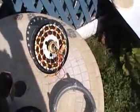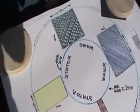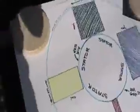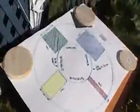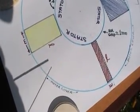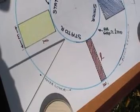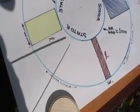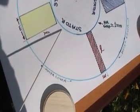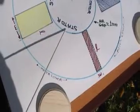With ceiling fans, however, we have to put rectangular magnets in there. I made an illustration — I exaggerated the gap. When I talk about gap, I'm talking about the distance between the air gap (shown in blue) and the motor cover. There's the stator, and there's a little blue air gap in between, without which the rotor won't be able to rotate. If it's touching the stator, you're out of luck. What we're concerned with is the space from that blue air gap line to the outer blue line.